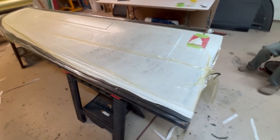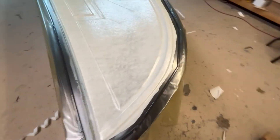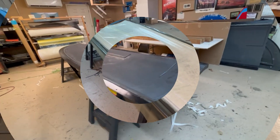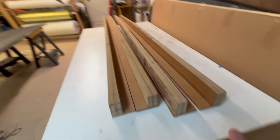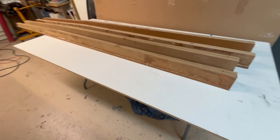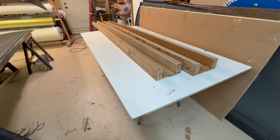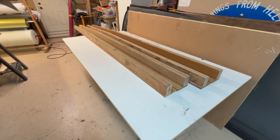There it is down under vacuum and it all looks really nice - everything went down tight, all the hinge lines look good, all the edges look good. So now we just let it cook. With that upper skin complete, today's mission is we're going to start on the spar. These are the spar tools - left and right C-channels - and they obviously don't fit on my makeshift table, so I'm going to buy some wood and build about an 18-foot long, two-foot wide table right here and build the spar on that.